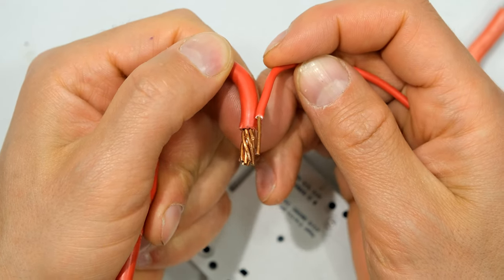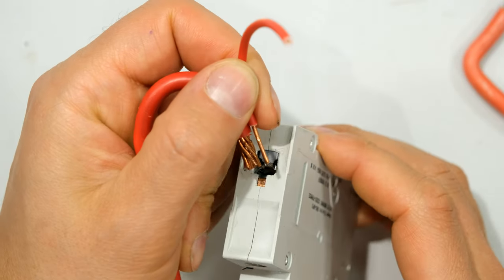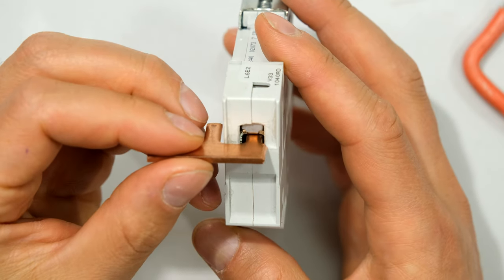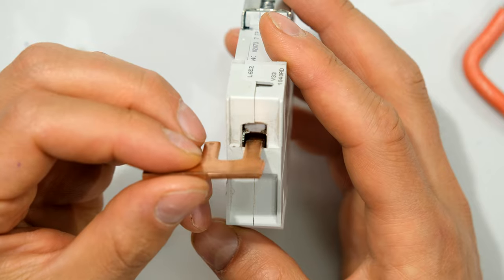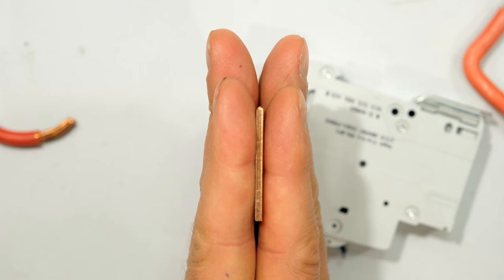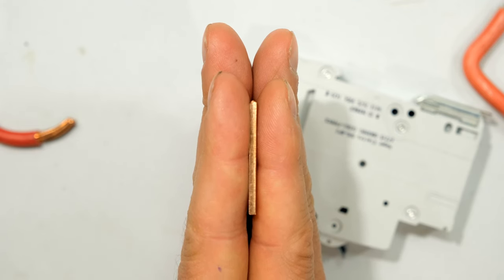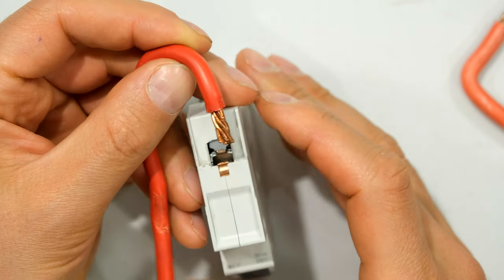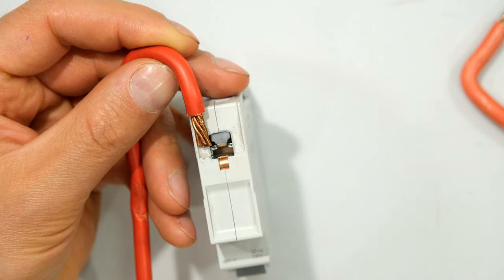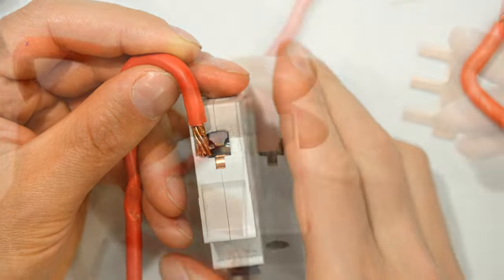The reason is that it doesn't quite compress — I would have to use pliers and twist the two together to ensure good contact in the terminal. If we look at the bus bar, you can see it is flat, so when I tighten the terminal it compresses directly onto both sides of the bus bar, giving an increased surface area and therefore reducing contact resistance. Also, copper tends to reshape after being seated and tightened, requiring re-tightening after a few hours or days.